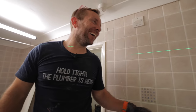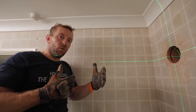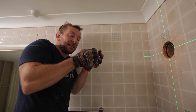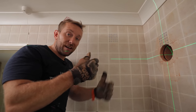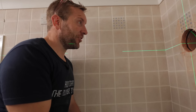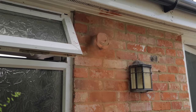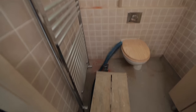Sometimes when you're drilling into a cavity, the cavity is deeper than your actual core bit. In that case, get in there with a hammer and chisel, chisel out and break down the core plug to remove it so you can continue cutting. You'll know this is happening when you see the inside of the core bit go shiny at the back, or see a mark on the center point of the brick, or you're just not going anywhere. In the end you'll get through.